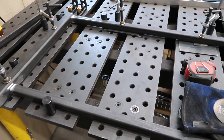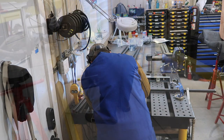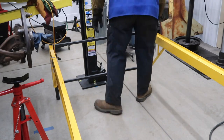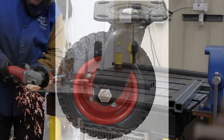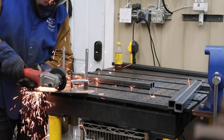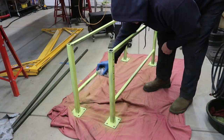We then welded on four foot long cross braces to make the dolly's legs. This gives us a four by six dolly that is good for a full-size truck bed. To make the dolly moveable on uneven ground, we chose six-inch rubber knobby wheels from Amazon. We cut out some mounting plates, drilled out the bolt pattern, and then welded the plates onto the dolly's legs. After spraying with paint, the end legs were ready to go.